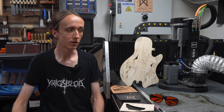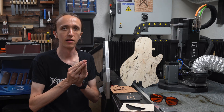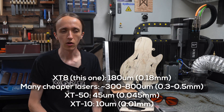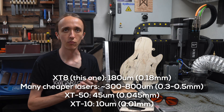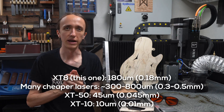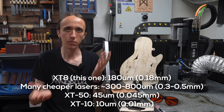One other difference in terms of engraving between this large cutting-focused laser head versus their smaller engraving-specific head is the spot size. This one has a pretty decent spot size for a diode laser compared to cheap lower-powered Chinese ones, and it is still a smaller spot size. However, their engraving-focused one has an even smaller spot size, which means you can resolve that much finer details. It also means that if you are doing scanning, you might need more lines per millimeter for it to look detailed — so it is kind of a trade-off.